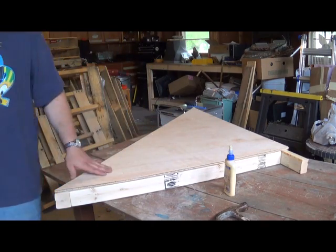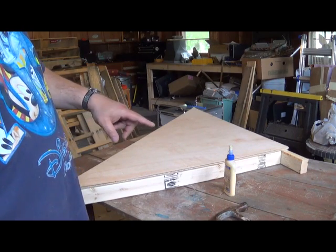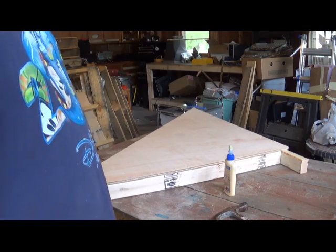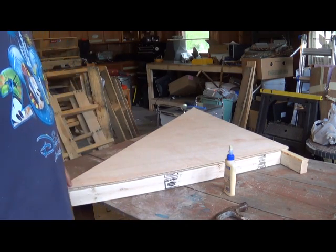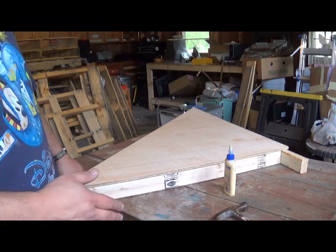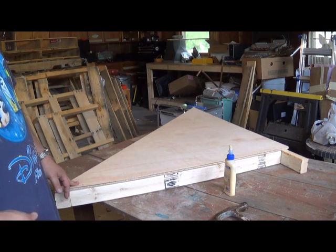So what you're going to do is, with a circular saw, make sure you get a finish blade. It's labeled just that, so it doesn't leave a lot of splinters on the end of the plywood. And you're going to measure off however many inches you want and cut it nice and straight. It really helps to get a 4-foot metal ruler to make that line to guide you.